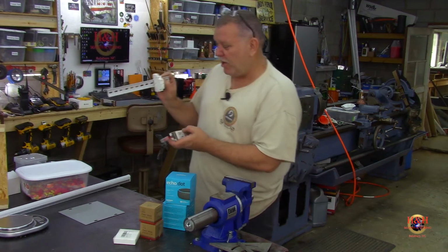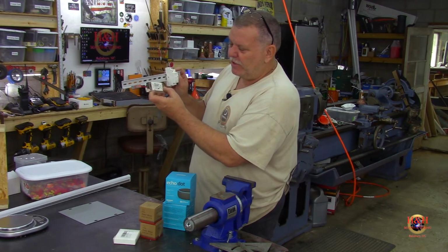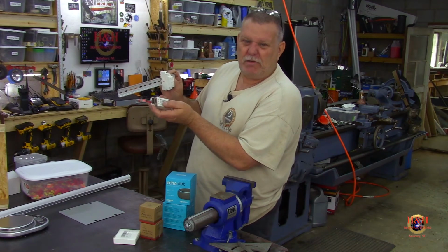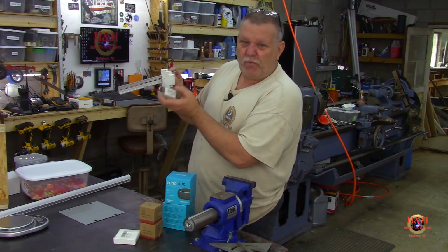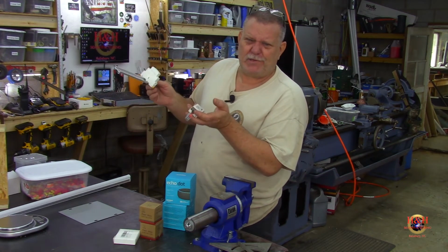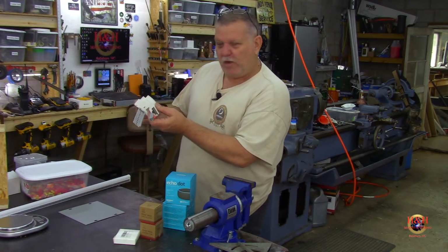I bought an 8x8x4 indoor utility panel. And then this will mount, and I'll cut out just enough for this part of it to be out. So you have a push button switch inside the relay itself that you can override. Like, if your Wi-Fi is out, if your power is out, nothing's going to work. So if your Wi-Fi is out, you can just click it and turn your lights on. So we'll neatly route all this stuff.